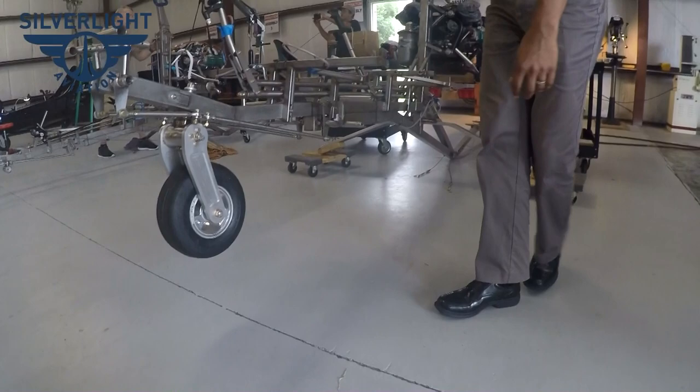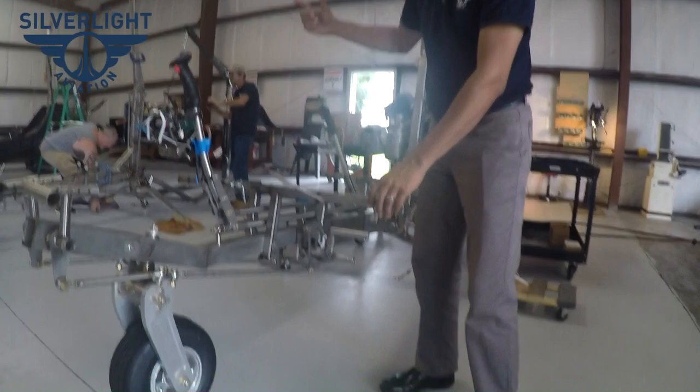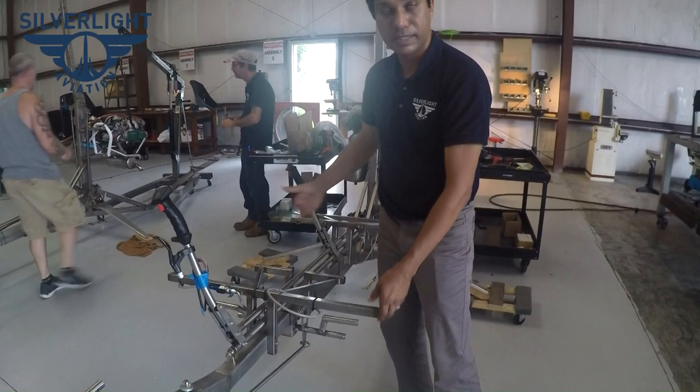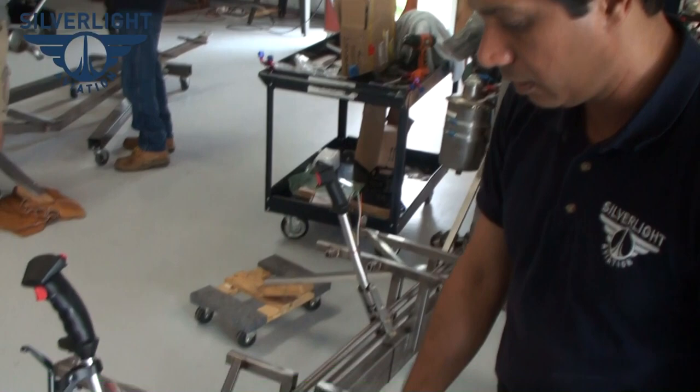By absorbing between the tire and the suspension here, the peak shock load that goes up a pilot's spine in a hard landing or a crash gets reduced, possibly saving the pilot's back. We saw in an Apollo accident that the peak shock load got transferred this way, which is the same thing that would happen in many gyroplanes of this style.